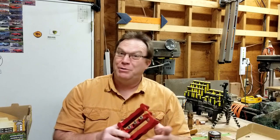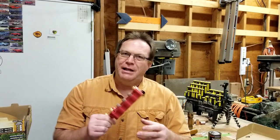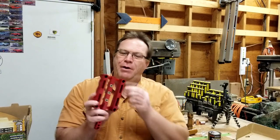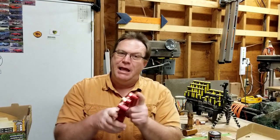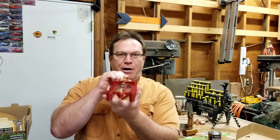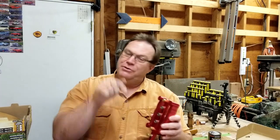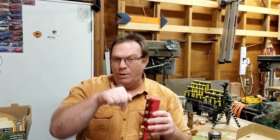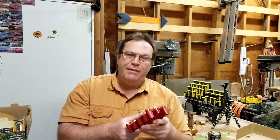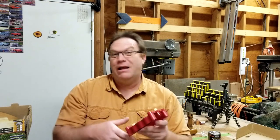Let me back up and explain what happened. Just before I got done, near the last few holes, this tool came apart. Apparently these screws in the bottom had not all been fully tightened, and from the constant moving it wiggled them loose. Prior to the screw falling out I didn't realize they were loose, and what happened is this bar in the center kind of shifted a little. So as I was drilling, the holes weren't going in straight — a little bit of an angle. I didn't realize it until the glue-up, when some seams didn't line up, and once clamped together I ended up with a concave shape.